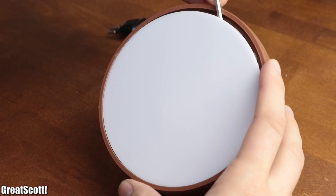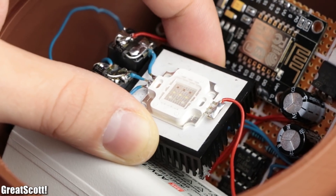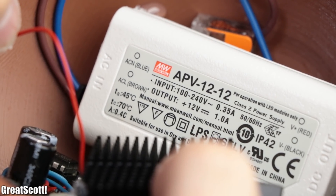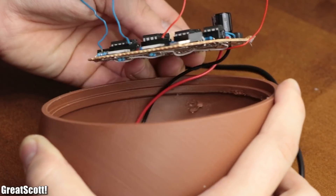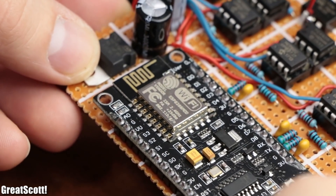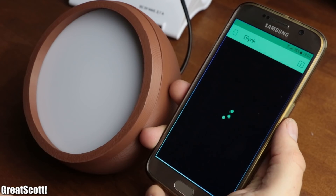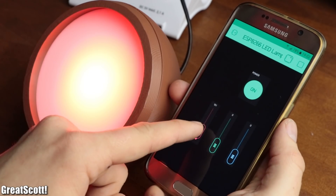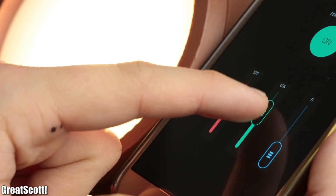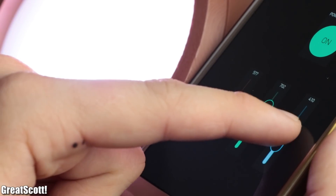The insides of the lamp are a bit more complex though, since they consist of a 10 watt RGB LED with suitable heatsink, a 12 volt 1 amp power supply, and finally a 3 channel constant current driver circuit that is controlled by the ESP8266 microcontroller. Due to its Wi-Fi capabilities, the lamp can thus be controlled by your smartphone to increase or decrease the brightness of the red, green and blue lights in order to create any color you could think of.